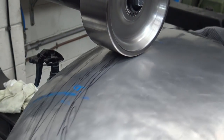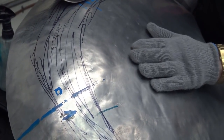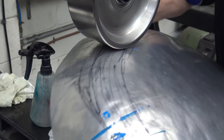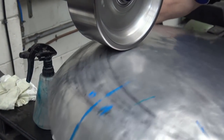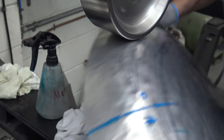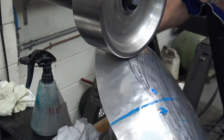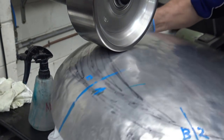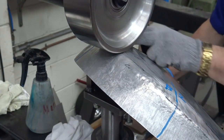One more thing I like to mention is that I'm not wheeling here, not yet, because chances are that if I wheel here now, I get it too full. Don't forget, I've got a fairly full wheel in there. Have a look at my motion here on the tighter part of the guard, if you like. Again, notice I wheel here, but not there.